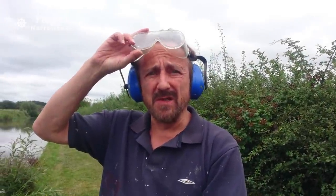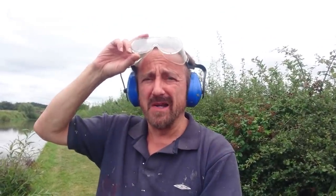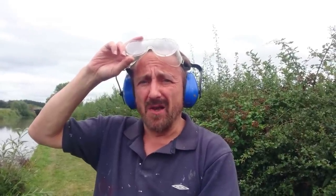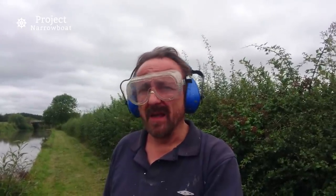When you do anything like this, safety is of paramount importance — you don't want to be getting an injury and spending the rest of the day making your way to the nearest hospital and waiting in A&E. For me it's a good pair of ear defenders, because I've suffered with the old tin ear as it is, and then a good pair of goggles that completely seal up around the face so no bits can fly into your eyes. You can wear gloves if you want to; I tend not to because loose threads could get caught up in the spinning parts.